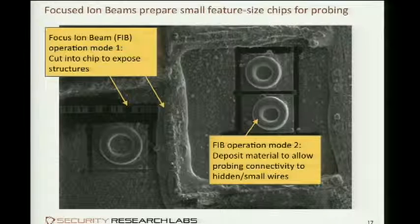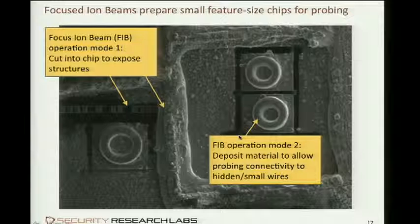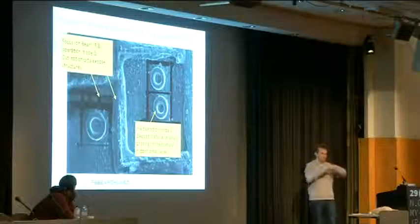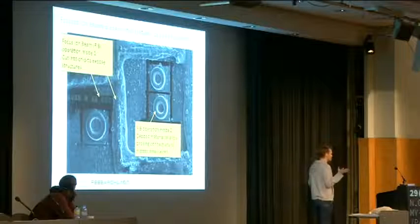Right? So this is enabling somebody like Dexter to just use the standard needles and get the data out of this chip. He did some cleanup then. You see these cuts. This is so that the two metal pieces are not actually connected, and a whole bunch of small other things. So this is really magic how these tools are operated. But you can imagine doing anything now with a chip, right? Even connecting different wires that were previously not connected. So you do edits on the circuit.